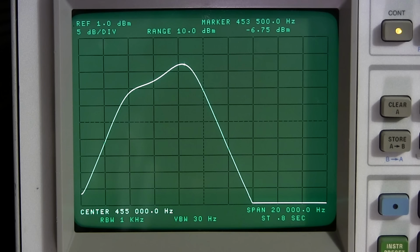There's a little, almost like a spring tensioned washer that keeps them tight. It's pretty common for those things to mar up the little brass shafts that are coming out of these little IF transformers, the little threaded shafts here, and I'll show you them in just a little bit. And there is absolutely no marking on them at all, and where you stick your screwdriver into the end, they're absolutely clean. So I'm really beginning to think that this thing does have its factory alignment.